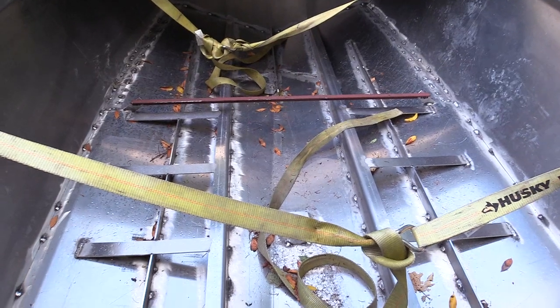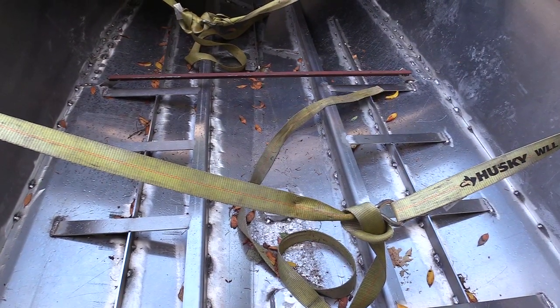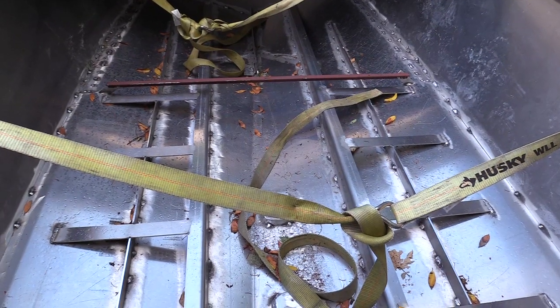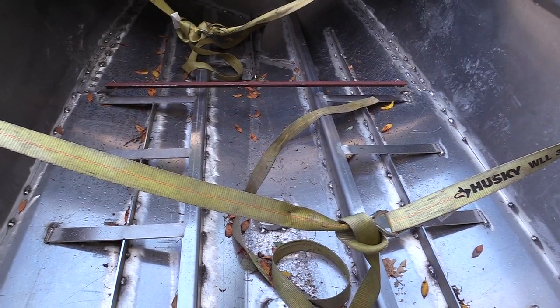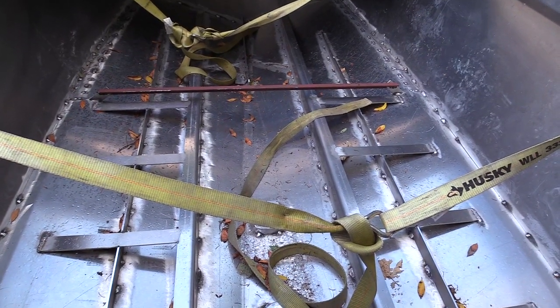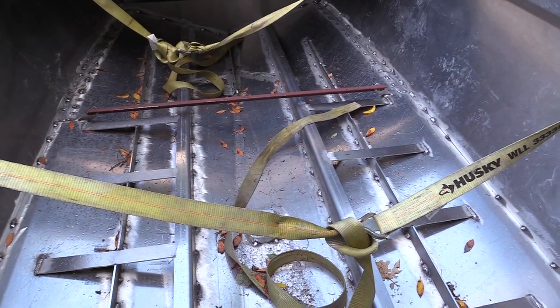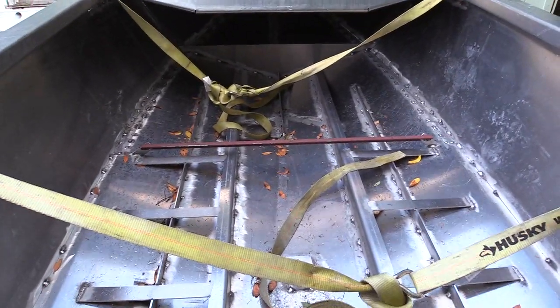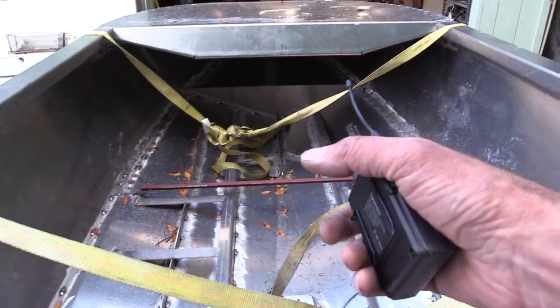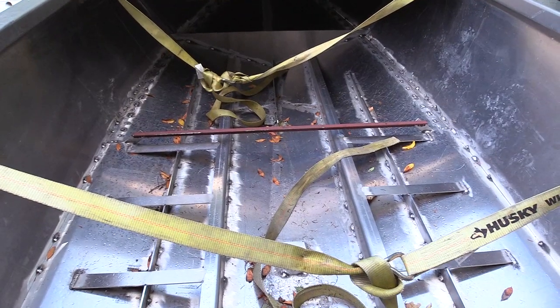So, it looks like it's not correctable. You know, I don't even know if I had that keel out right now, if I could get the job done. You know, it's 10 millimeters thick. I can't do it. You definitely need a large press, and I believe you're gonna have to somehow secure the back square, build a jig for the front, and make that front conform to the jig.